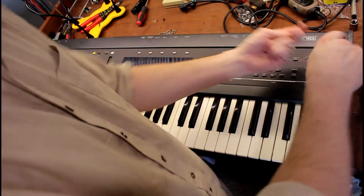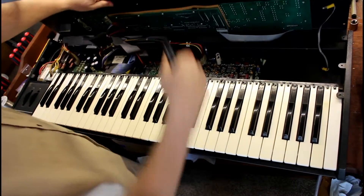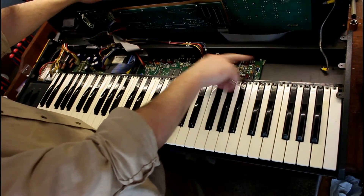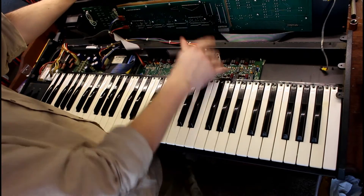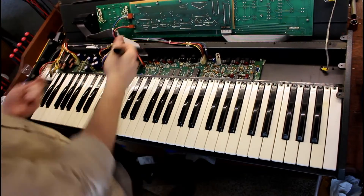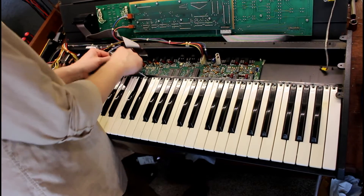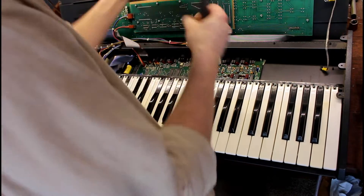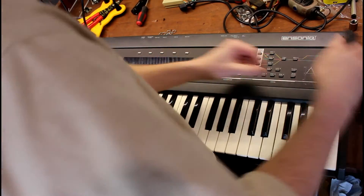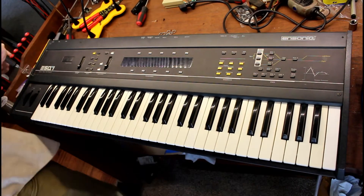The first step is to take these four hex screws off the top, and then either one of two things. If you have the version of the ESQ-1 which has the battery located somewhere about here and it's running left to right, then you can simply desolder it from the top of the board, remove it, put another one in — no big deal. If, however, you've got this other version that has the battery over here running vertically, it's a little bit too tight in here to try and get a soldering iron next to this connector and the frame for the keyboard. So what I recommend is to first screw the cover back on the top panel — and this is how to remove the main board.